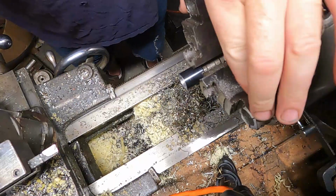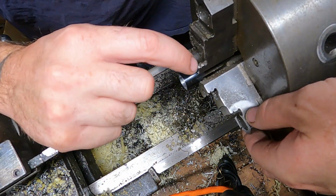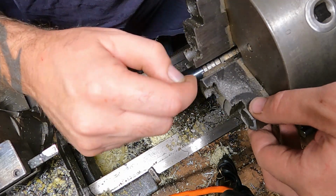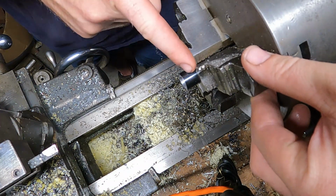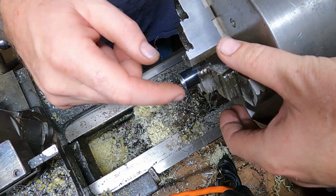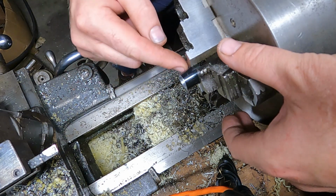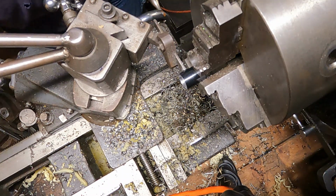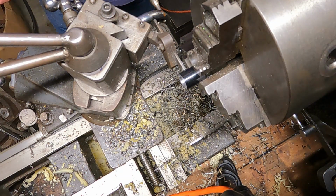Just that shiny. I think what I'm gonna do for cutting these to length is there's little serrations on the back side of these jaws on the inside. I'm gonna bury the part just 2 serrations deep and then set up the parting blade and part off just shy of this line I made inside of it. And then we'll do every one that way. Then I'll turn these around, stick them back in the chuck, and face that end off until I get the measurement I want. And I never have good luck with parting. We'll see how this goes.